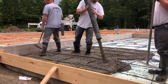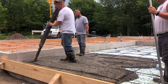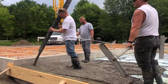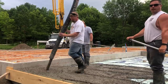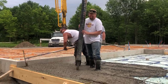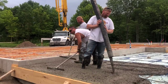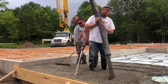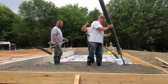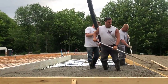You can see here we're using a pump truck to get the concrete to where we need it — we couldn't reach this right from the back of a concrete truck. We're pouring a 4000 psi concrete with microfiber in it for reinforcement, plus it's got rebar in it. I always use a water reducer in my concrete, which allows me to pour a looser slump to make pouring easier without affecting the strength. The water reducer is put in at the concrete plant when they batch the concrete.